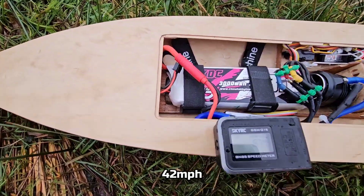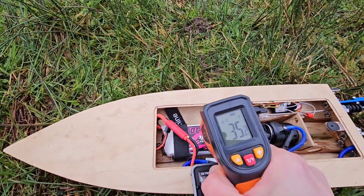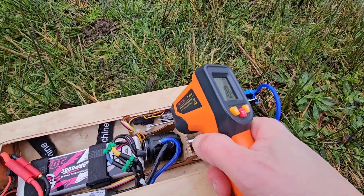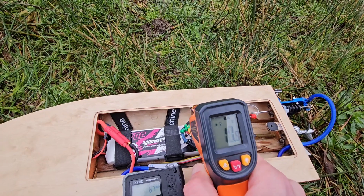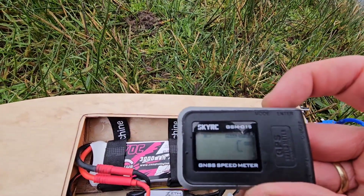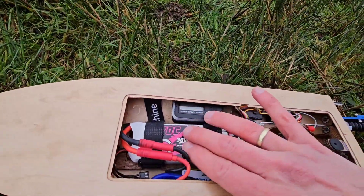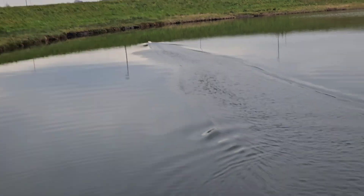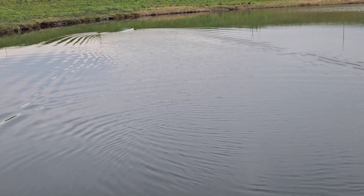What is the speed? 67 kilometers an hour — not bad on a cold day like this. The LiPo is 36 degrees Celsius, the motor is not even hot, and the wiring is not hot either. I'm going to reset the top speed, set zero, install a fresh LiPo, and let's see if we can beat the top speed of the first run. I'm going to down-rate the steering throw.